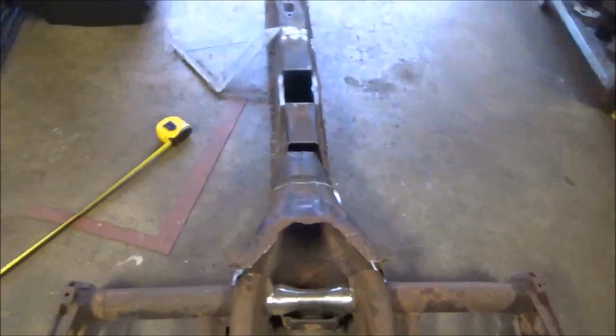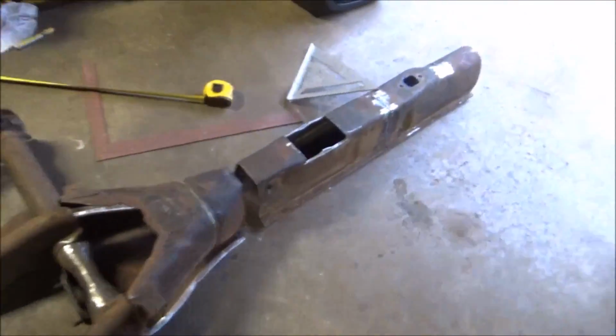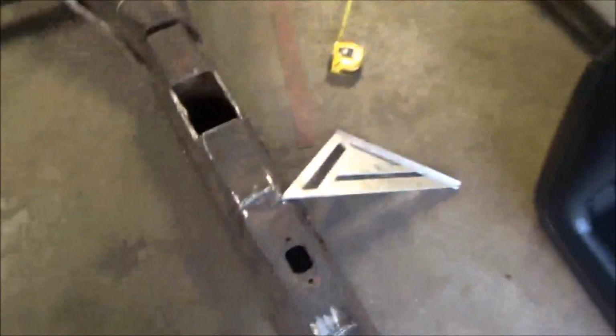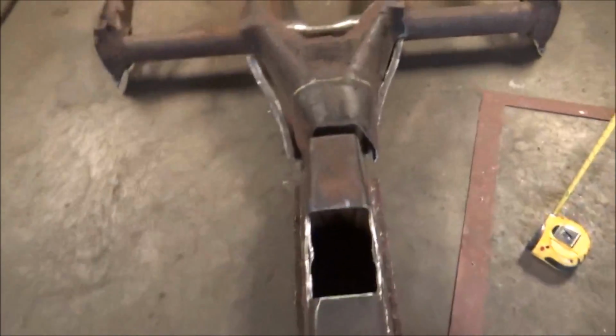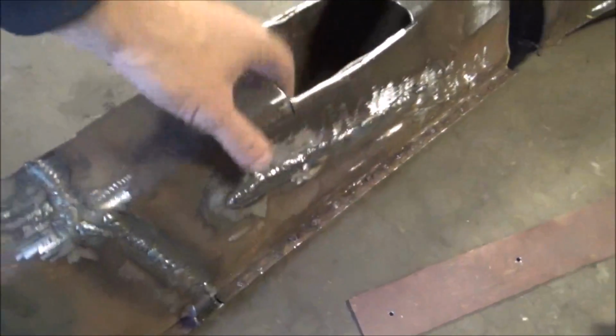All right, I'm going to trim that piece and have some fun, and maybe I can tack it together. I'll show you what I was doing. You can even see it. I was using a flathead screwdriver and just peeling the sheet metal off here. It all looked like this, rusty edges of old floor pans. Now it looks like this. Just gotta be cleaned up. Grind those spot welds down. We'll have a nice clean edge.